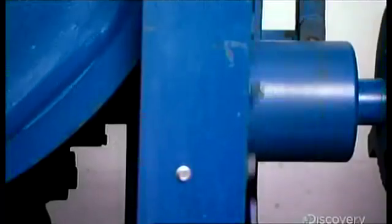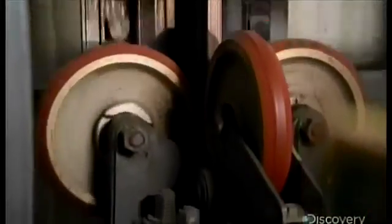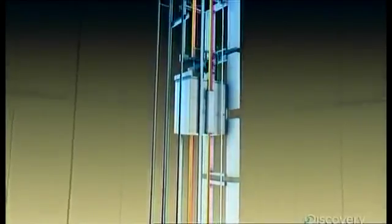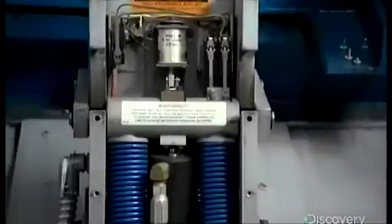Once the car is moving, the motor's only job is to control one of the two falling objects. Both the car and counterweight are attached to guide rails inside the shaft. They keep everything from swaying back and forth and also give a backup set of brakes something to grab onto. If anything goes wrong with the motor, hydraulic fluid is cut off and that automatically releases this brake that seizes the ropes for a quick stop.